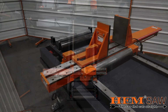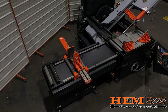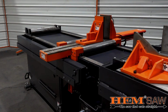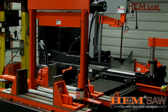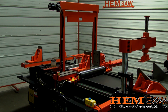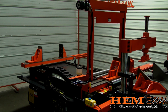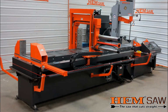A 0 to 48 inch stroke hydraulic motor bar feed comes standard on VT100HA. The bar feed has multiple indexing capabilities for longer cutting applications. A 0 to 48 inch and a 0 to 120 inch stroke Servo twin ball screw bar feed are available as an option. The Servo bar feed allows for faster movement and higher repeatability. The 120 inch Servo bar feed includes a third holding vise.